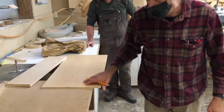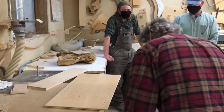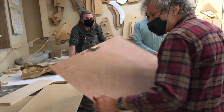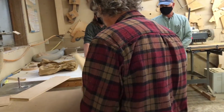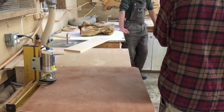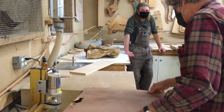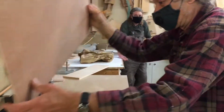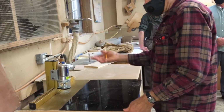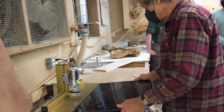Now the 1/2-inch plywood, the holes get centered better if you use, we put this 1/8 inch on top here. When we do the holes in 1/2 inch, they get centered better in it. Or else if you don't, they're too close to the edge. So we use that with 1/2 inch, and with 3/4 we just go right to the table. What about 1 inch? With 1 inch, you just go right on the table. And we don't make cabinets 1 inch very often. Okay.